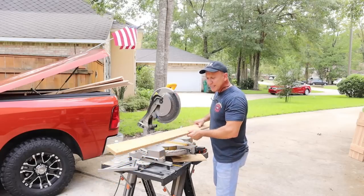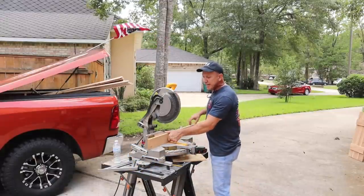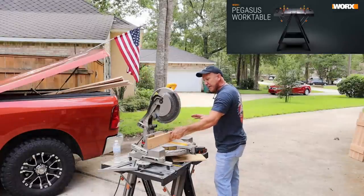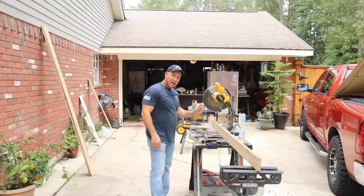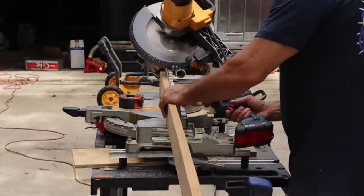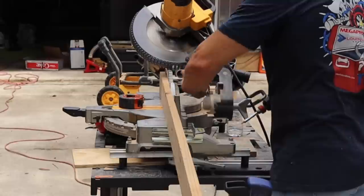I want to set this up so I can make all my cuts easily. I'm going to take a one-by-four — your saw has holes set up for this — and screw it from the back side to attach this board. That way I can put a clamp with a block and have all my boards cut the same size easily. It's easy to drill your own holes if they don't have them; it's aluminum so you can always add your own. I need 73 inches on this side of my blade, so I'll back it up and scoot this part over to get that distance.